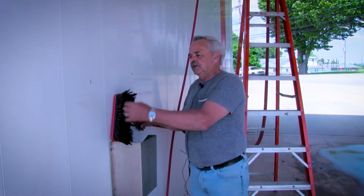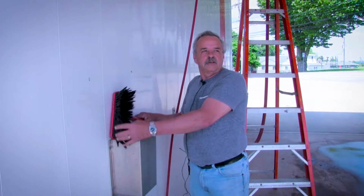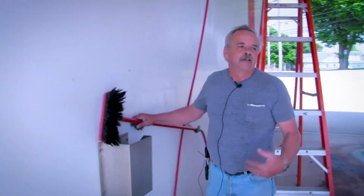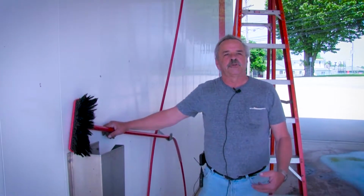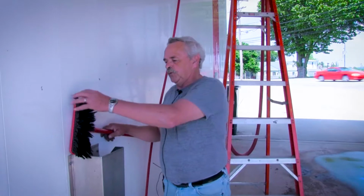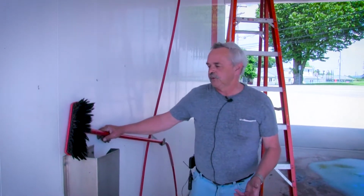If you can see, it's starting to separate. So as the foam comes out of it, it doesn't come out on a real loose basis. It comes out in chunks in the center. It doesn't make any difference as far as what it does to the car and how it goes on the car, but it's more appealing to the customer if you actually see foam coming through the whole brush instead of just coming out through the center. That's one reason why I changed mine.